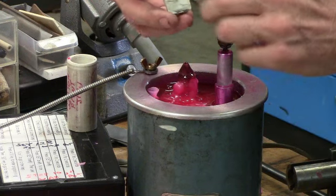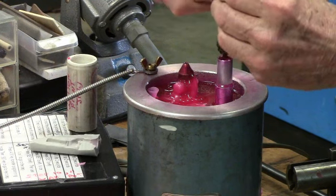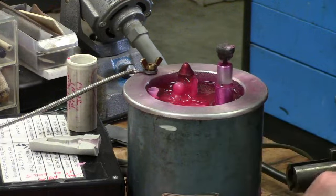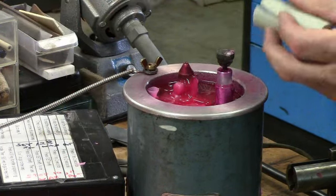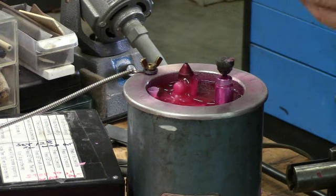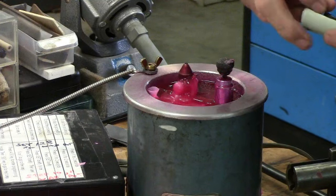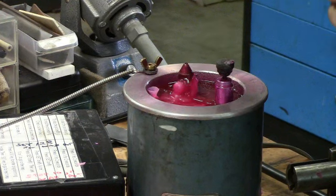This was the second one that we injected. It's the front jaw. It also has a core in it. And we just do a slight twist and pull the core out. And there's another wax model. Same procedure, put your core back in the mold. Drop the mold back into the mold frame. Okay, I put the core in backwards. It's always harder to do something when you're trying to film it. Okay, let's try that now.